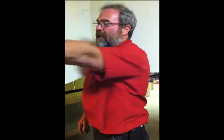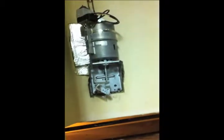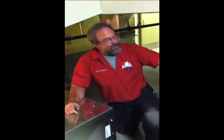This fan is running and we're drawing air from outside through this ductwork. There's a set of dampers inside this duct — that actuator right there is what's connected to the dampers inside this ductwork. And there's another set of dampers right here. They modulate back and forth to determine how much outside air or how much return air you're bringing in.